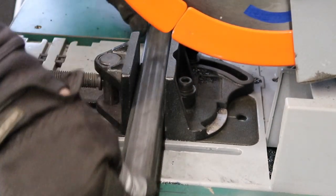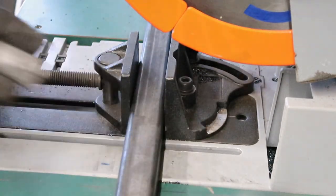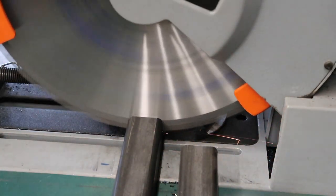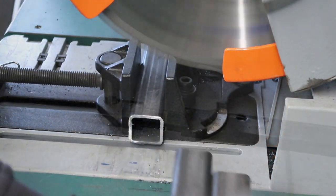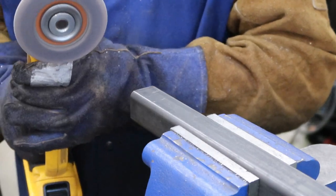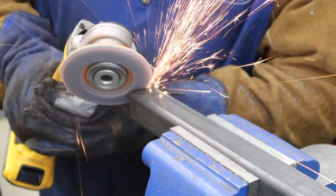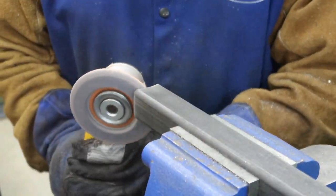Next we used one and a half inch 10 gauge square tubing to cut frame rails into lengths of 12 inches and 18 inches. There are two frame rails per leg assembly. We'll use one inch square tubing to attach each leg assembly and make the dolly adjustable. We used a flap disc to round the ends of each frame rail so they could fit around our eight inch legs. We could have used a notcher, however we don't have one.